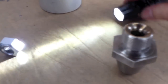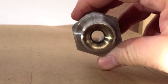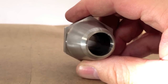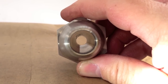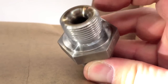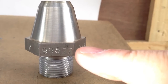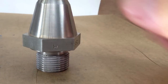Here the steam nozzle is shown by itself, removed from the steam chest. There is the inlet to the steam nozzle. There is a round radius down to the orifice, and this is the discharge end of the steam nozzle which has a larger diameter. The inside of the steam nozzle is smooth and you can see the orifice is round. The threads on the steam nozzle are straight SAE threads. There we have the job number engraved on the side of the steam nozzle, indicating the part and the distinctive serial number that this equipment was ordered under.